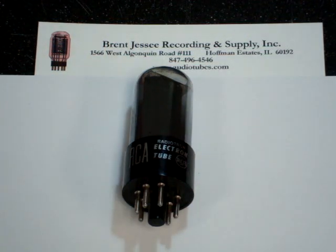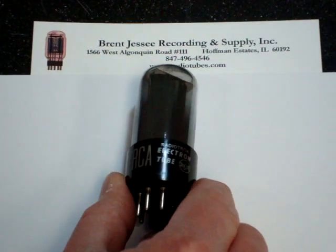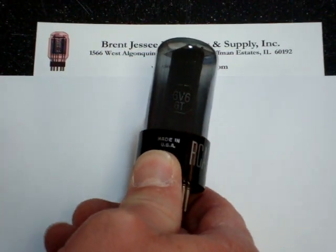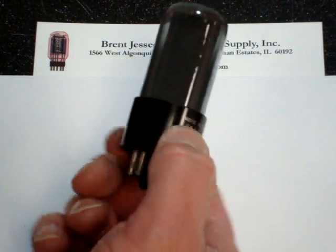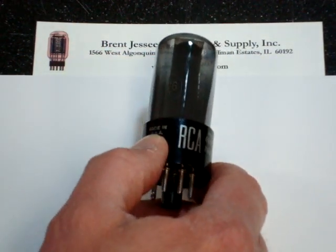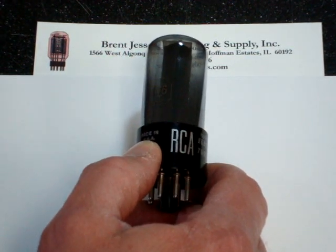This is an instructional video about the 6V6 tube, perhaps one of the most important tubes ever to come out of mainly the RCA laboratories, and is widely used in a variety of audio amplification purposes, especially its famed use in Fender guitar amps. Probably the most popular is the gray glass RCA 6V6 GT. GT merely stands for glass tube, and the gray powdery inside is basically an RF shield sprayed on inside the glass to prevent the tube from picking up hum and noise.